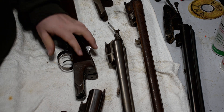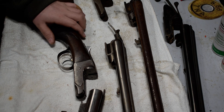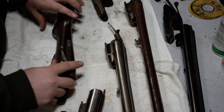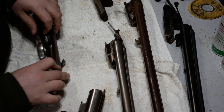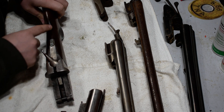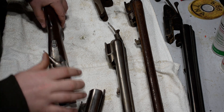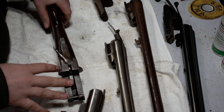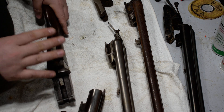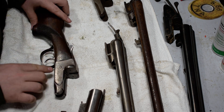If she's black with oil soak, that's rot — it's a sign this is all going to start breaking apart. That's the first sign. The second sign is if she's split along the back or on the underside — usually top first, bottom second. That's a sign the bedding has failed because the metal is acting as a wedge pushing back and the wood is giving out. To fix it, everything has to come apart, be scraped out, re-filled with Acraglass and shaped — it's a full afternoon to a two-day job depending on the stock.